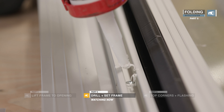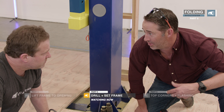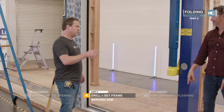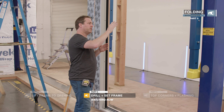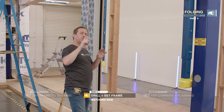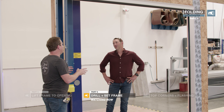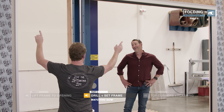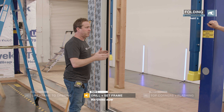The head beds in the sealant and then we come over the top and put a surface seal. There's a lot of sealing — jam, jam, sill, and most importantly the head, because all the weight is going to be hanging off that head. There are two channels. The front channel, where the wheels actually roll, is going to have a screw that goes in at a slight angle, and on the interior channel they go straight up. What we recommend as we put the screws into the head is a slight eighth-of-an-inch crown over the span of the system — from jam to jam, an eighth of an inch crown in the middle of the head. This allows for any settlement while still allowing it to function properly.